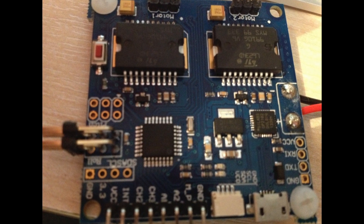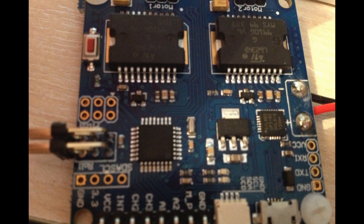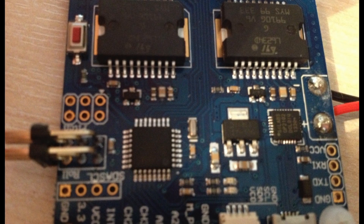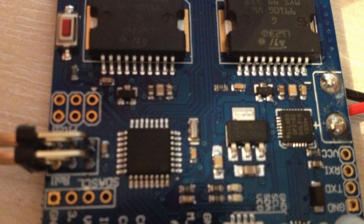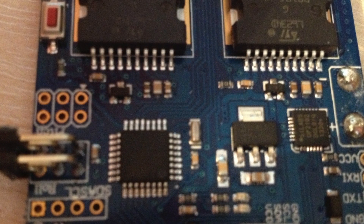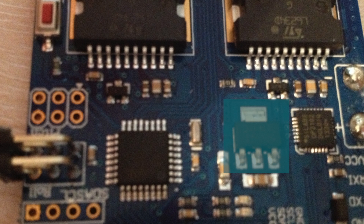This was because I'd taken from my receiver the 5-volt ground and signal cable and connected that to the tilt control on the controller, and that 5-volt seemed to have just gone through and blew something up. So the tip there is only to connect the signal cable, not even the ground. I thought I actually located the faulty component as being a voltage regulator, and I actually replaced that — thanks to Badlands, who had a couple of spares and sent me a bunch.